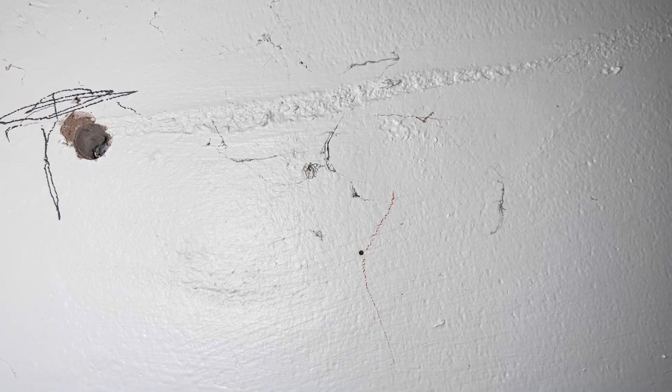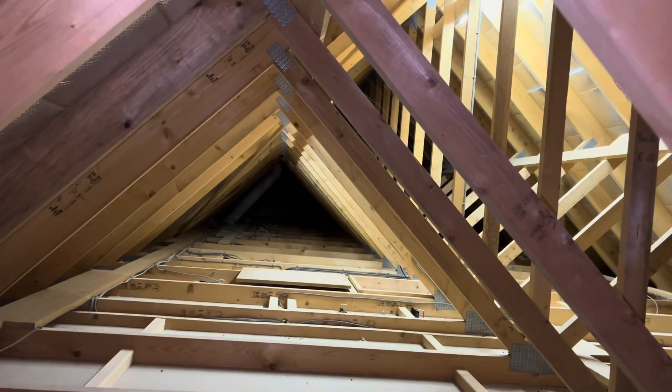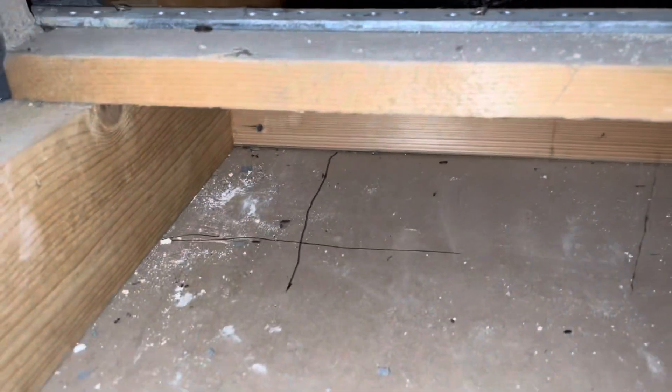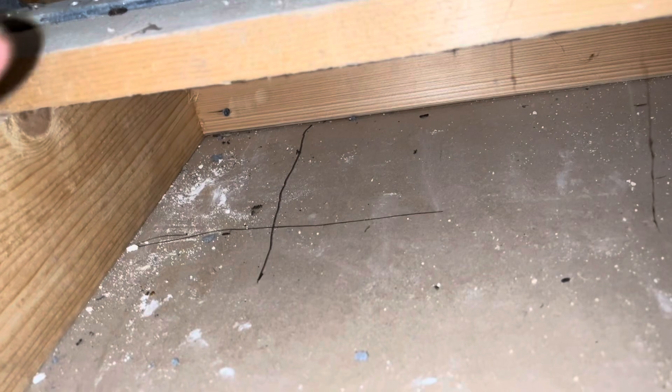The first thing I plan to do is get at least one pipe through here — I've marked a hole where the centre of the pipe is going to go. I'm going to go up into the loft and make a 90mm hole there to check that I can get the pipes down through this and into the lounge below. Up in the loft above that cupboard you can see down that end is where the pipe goes down to the boiler room. Unfortunately there's not as much space as I hoped because there's a plank of wood in the way, so I've marked where I can drill a hole. I'll now mark on the other side in the cupboard where I can cut the hole to check it's big enough to get a 90mm pipe down through here.